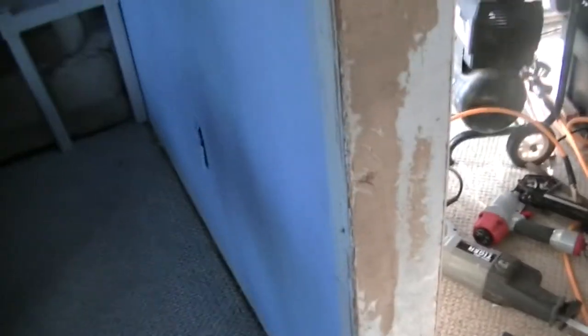The next step is to cut for hinges, and I've got a very cool tool for that. I gotta find it real quick. Made quite a mess for myself here, as usual. So this is a door template, hinge template, for a 3.5-inch hinge. It's very well designed. It has stops here. It's got a little tiny bump on the very top to give it about 1/8 of an inch clearance on top. I will use a router to route these out. These are actually pins that I hammer right into the wall. And I just got to make sure that my router's at the perfect depth and do that. Before I do, there's a really awful patch here. I'm going to see if I can sand it down a little.